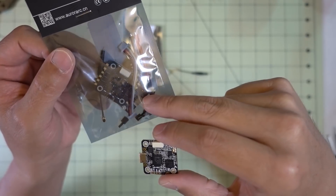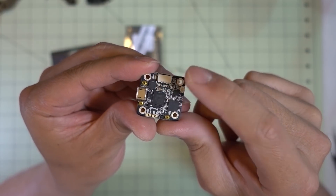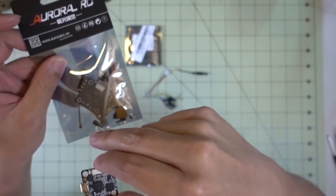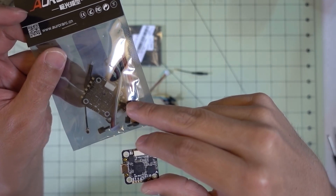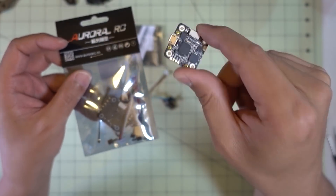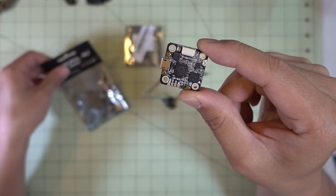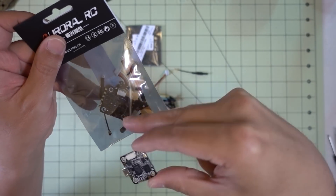This package is designed to work together — the wiring loom will work with both boards. Just keep in mind that the connection requires VBAT power, not 5 volts, for the flight controller. The 4-in-1 ESC in this combo will output VBAT, so be aware of that. Some 4-in-1 ESCs output 5 volts instead, and some flight controllers expect 5 volts instead of VBAT, so make sure you check the documentation and confirm compatibility. I would just recommend getting this combo package — the second link in the description — to make sure everything works correctly together.